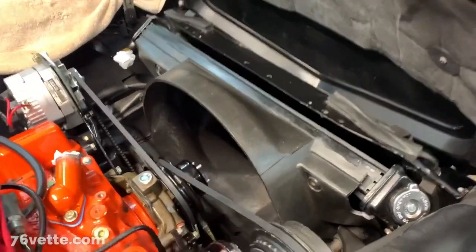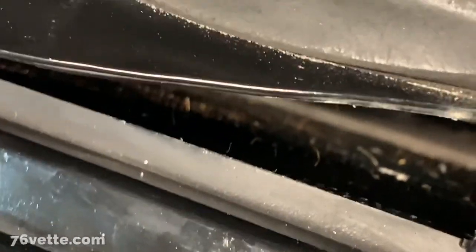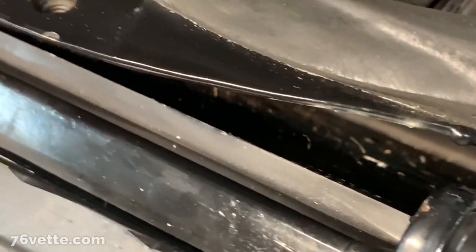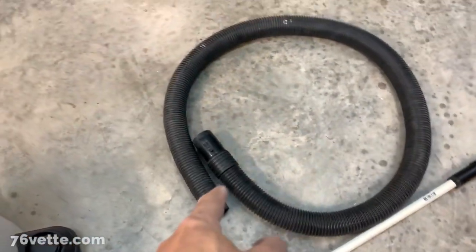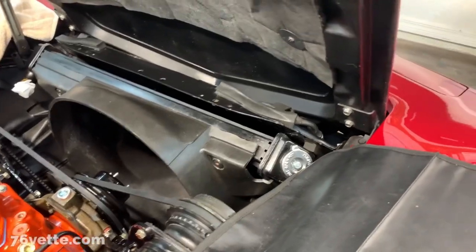I'm done with all the vacuuming and it is not perfect, but it's a lot better. There are a lot of twigs and little things caught between the fins and unfortunately there's nothing I can do about that, but for the most part I got most of it out. I also grabbed the two-and-a-quarter inch hose — my vac has an exit port so I can blow air out instead of sucking dirt in. I blew some of that trash out, then vacuumed the whole thing again.